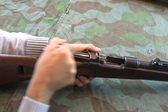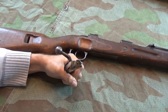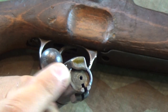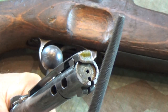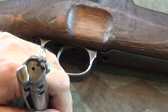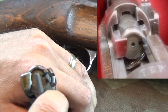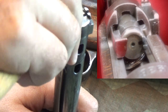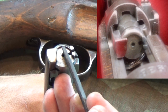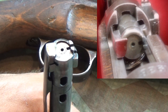Okay, so take the bolt out and compared to the photo of how it was before - what we've done is put a fairly substantial chamfer on it. I did this with a slightly rounded file and then smoothed it off with a stone. The amount of material I took off was quite a lot. I had to not only file and stone a chamfer on it, I also had to scrape back the edge because it was just too long and was really blocking any attempts to have it slip over.